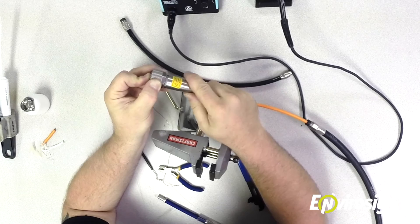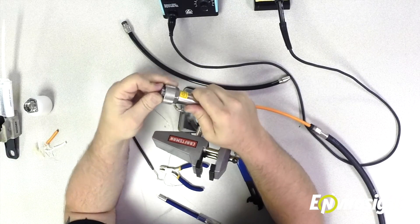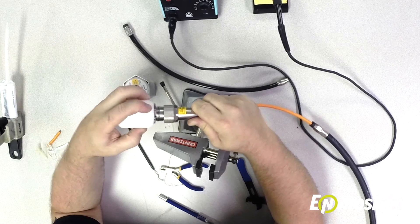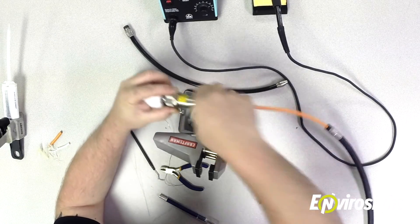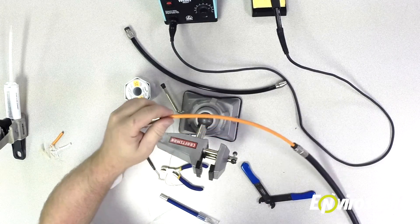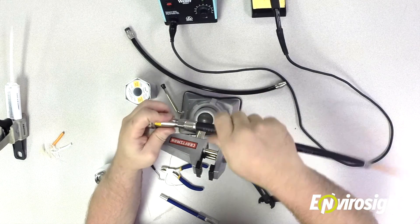Support it and slide up the back shell. Screw the back shell down, then grab your dummy plug to hold the front piece — don't use pliers or you'll crush and damage it. Now screw your back shell down completely and give it a tug back. You'll hit the back shell, which is what you want. Now slide up your rubber tail piece and screw that in.